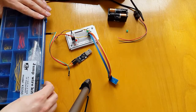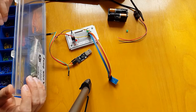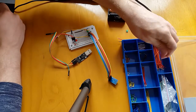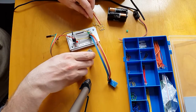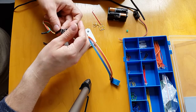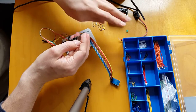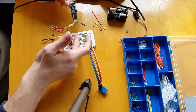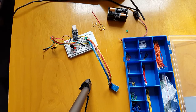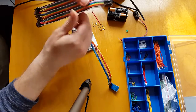Let's start wiring the position over here - we'll mark our place with the ground and RX pins, and try to use the shortest cables to keep it nice and tidy. Now, one other problem here is that there's the USB port, so maybe what I actually need instead of just jump wires is a set of male-to-female leads that I can plug straight in from there across to there. I definitely have a set of those - let me just find them in my robot cupboard.